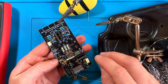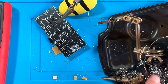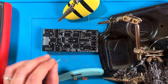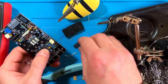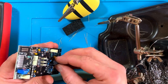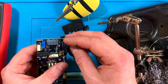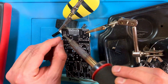Now install the trim pot, then the electrolytic capacitors. Make sure they are correctly oriented — these are polarized. Snap the ICs into their sockets, also making sure they are oriented correctly. I used the snake charmer technique to solder the first pin on the power connector, then solder the remaining pins. That's it for the circuit.